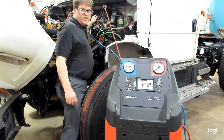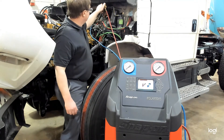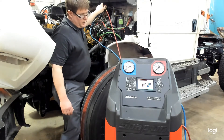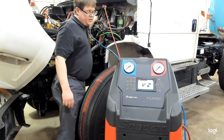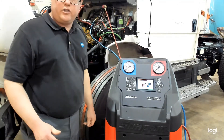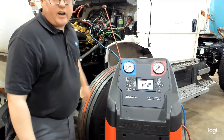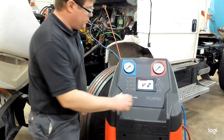This process is going to pull the remaining refrigerant out of the hoses. I know the screen says to re-close the side couplings, but I believe that's an error — if we do that it will not be able to pull the refrigerant from the hoses. So we're just going to back out the knobs on the hose quick-disconnects and then proceed to the next step.